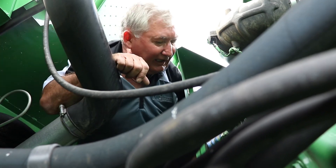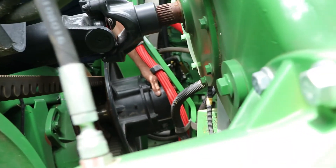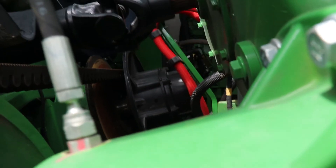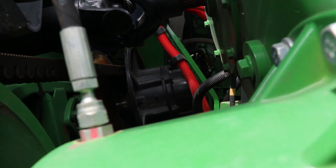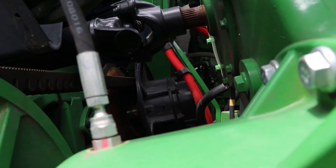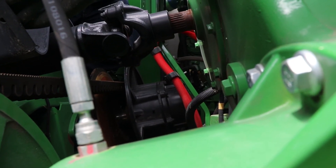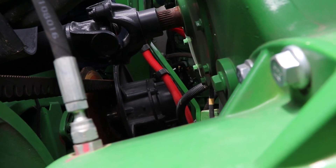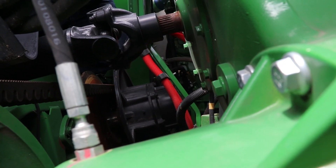You can come in here and on the back side of your rotor drive plug — if you take this plug out — you can fill it with grease. It uses corn head grease and does hold five tubes of grease if it's empty. You want to grease it until you have grease about a half an inch below the plug hole. Then you have grease in your rotor drive.